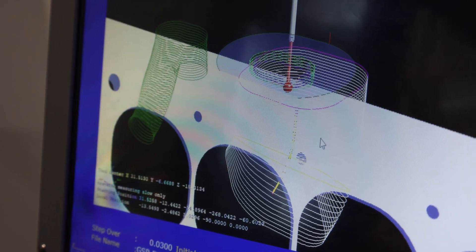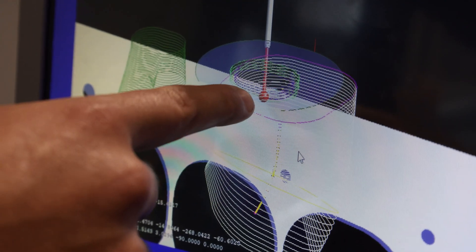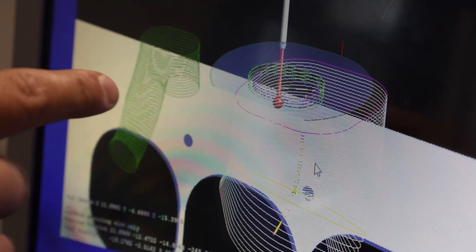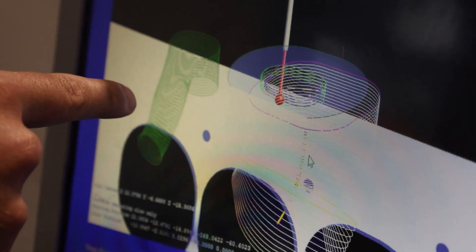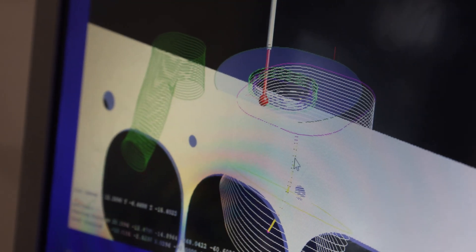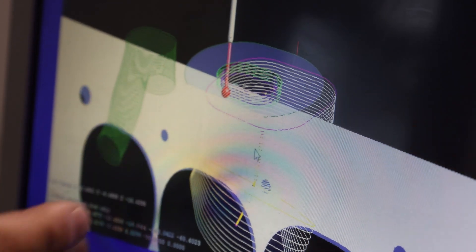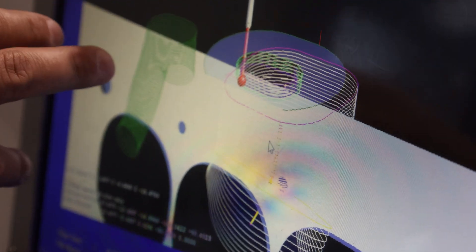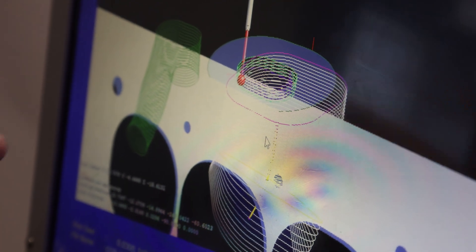What it's doing here is a 3D probing process — it's not actually a scanning process. What you'll see is this probe, as it's going along the screen, is picking up different points on the cylinder head and putting all those together to make lines that we make surfaces off of. Here's the exhaust port for cylinder number one that we probed a little bit earlier. You just define your planes to tell the probe where to go, and for a four-valve head with a single exit that goes down to two runners, you define which runner you're going down.